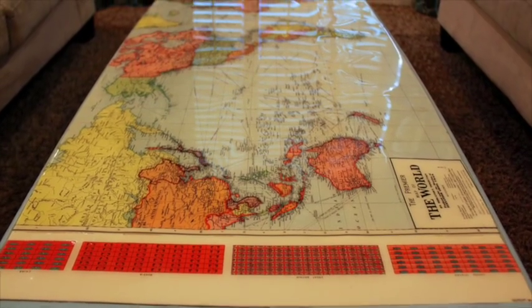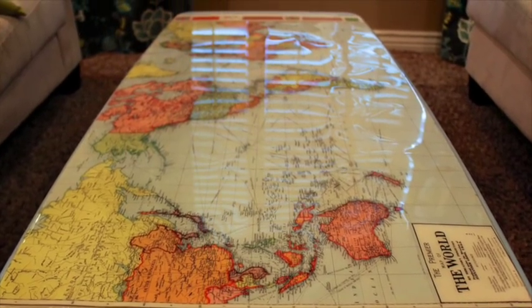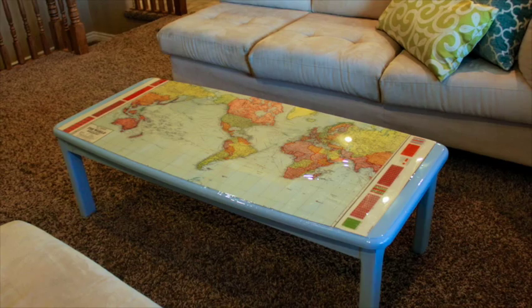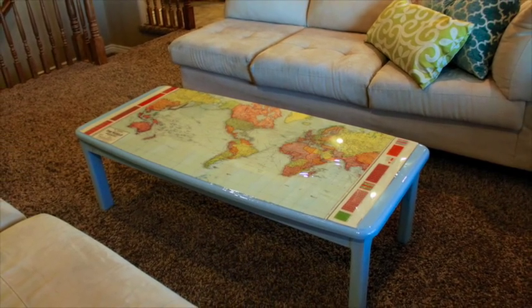After about 30 minutes, new bubbles should subside and most of the dripping should stop. You'll need to leave the table untouched for at least 8 hours as the epoxy cures. It doesn't even look like the same table.